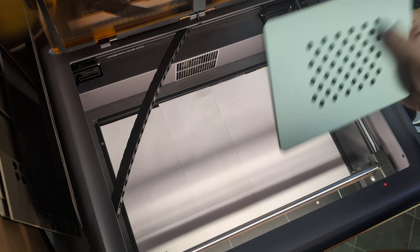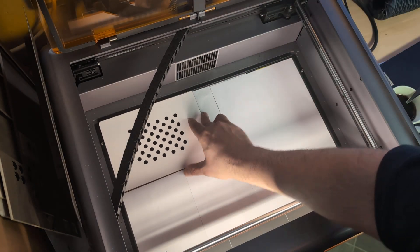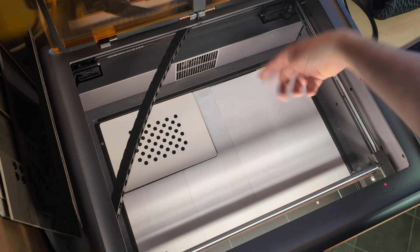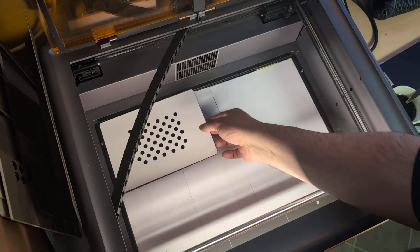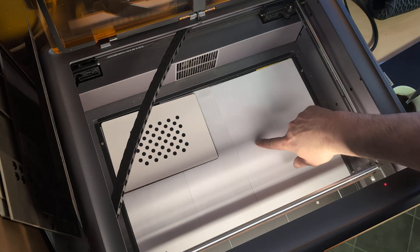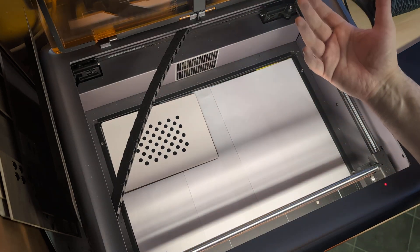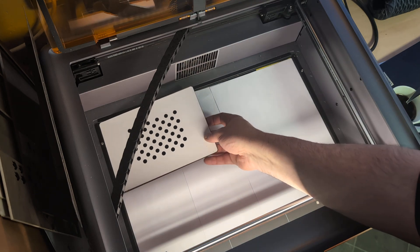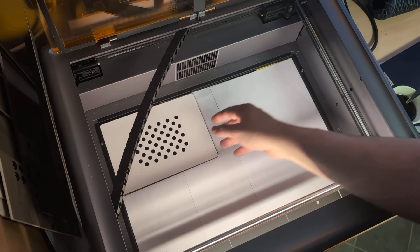When you're doing this, the idea is you've got an edge around this and you want to put it right in the corner. This pattern is basically in your print area, which is roughly that. Just do it as normal and pay attention to what the camera is telling you. If there's a shadow or something in the way, take your time and move it out of the way — that shadow might affect the camera. Do all the calibrations in every position and you're pretty much set.